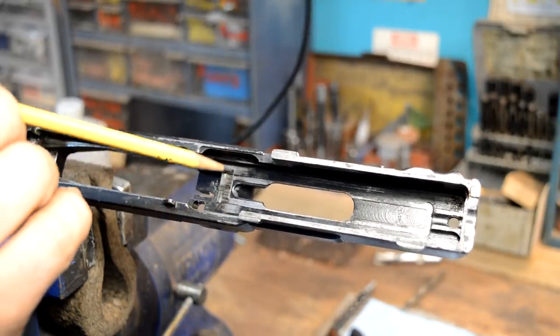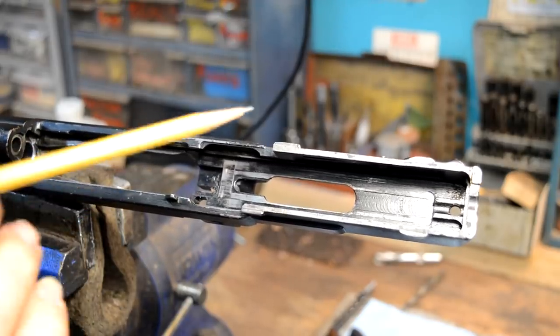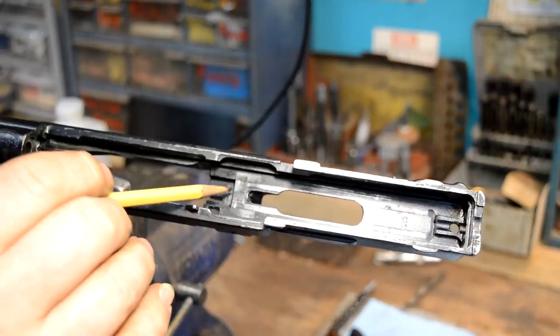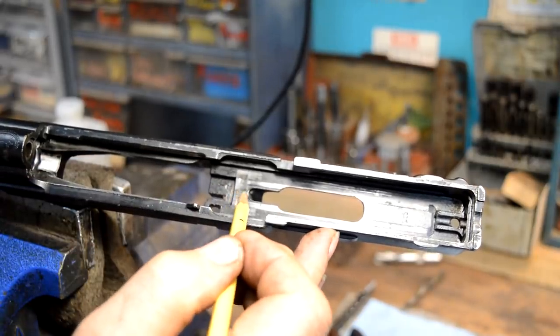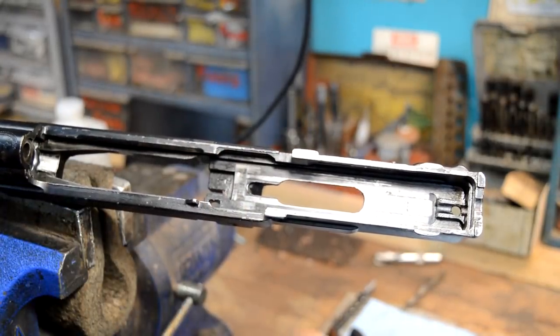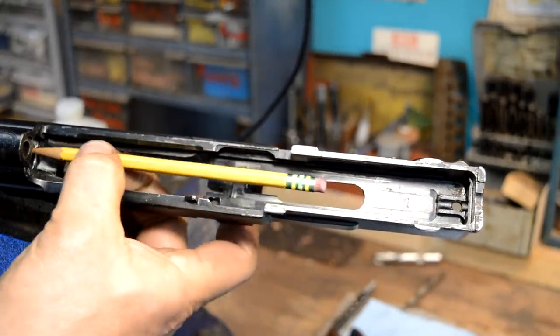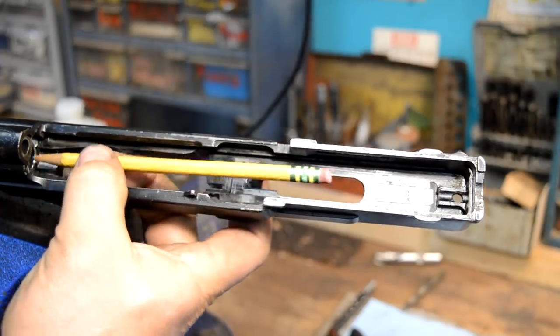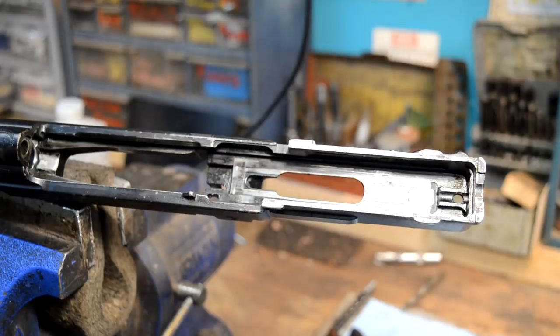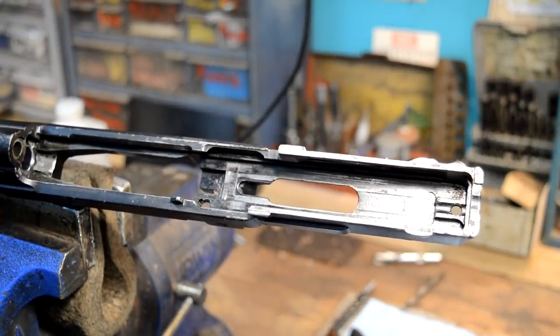Right here by the word 'Belgique' is this cool little piece of kit, and there's the back side of it - that is a removable headspace block. This is the abutment on this gun, but as the gun wears, just like on an FN FAL, you can put thicker and thicker tabs in here to move the bolt forward to accommodate any wear happening up in the throat. Here's the access for a cleaning rod to come directly down the bore so you're doing your cleaning from behind, so you don't wear on the crown. We do not want to wear on the crown on any gun because we need a clean release of the projectile out of the rifling - always clean your weapons from behind if you can.